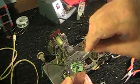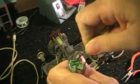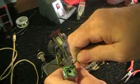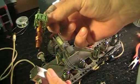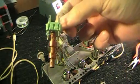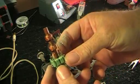The aluminum metal shield that's over this coil is held on by these two little metal tabs on the bottom, so we're just going to pry those up and get those out of the way so that we can take the coil out of the base. You can see the green base there — it comes right out. And there's a two-winding coil — let me give you a better view of this.